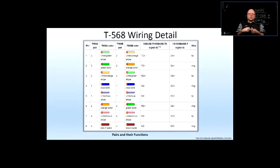Now, when it comes to making or using patch cables, those Ethernet cables that have an Ethernet plug on one end and an Ethernet plug on the other, you're using them to plug the port on the patch panel into the port of whatever other equipment. Usually it would be a switch or a modem or something else, but a switch would be the usual thing. Sometimes when you have to connect two switches together, it is required for you to use a crossover patch cable.